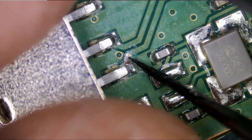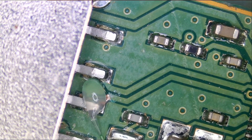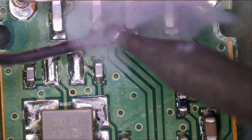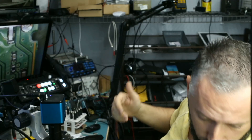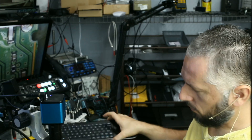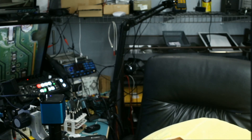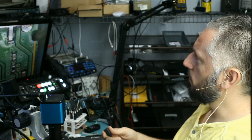It's clear that the line is cut off from here. What I'm going to do is apply a solder blob so we can connect those two pieces. I do not see a need to solder a wire. That should be enough. If that works, that would be the fastest data recovery we've ever done. Do we charge the customer less? Of course not. A job is a job — if it takes us three days or one second, the customer is not paying more when it takes three days. So it's either a win or lose situation for us.